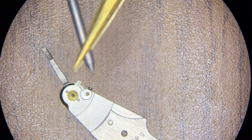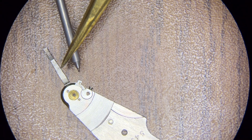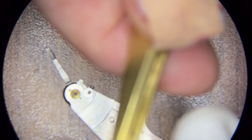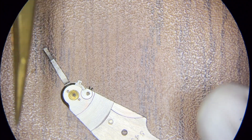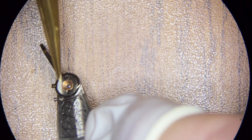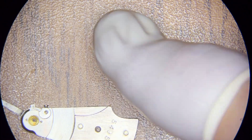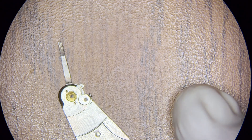I'm just concerned that I may not have the experience to know when a pivot gauge is bumping up against the end cap versus not going in at all. So just to be totally safe, I'm going to take apart this assembly so that I can test the pivot gauges on the jewel in isolation, and then I won't be fooled by the gauge bumping up against the end cap on the other side of the jewel. I will be right back.